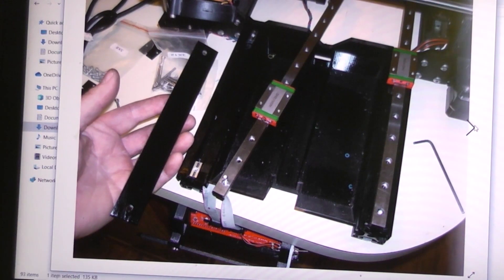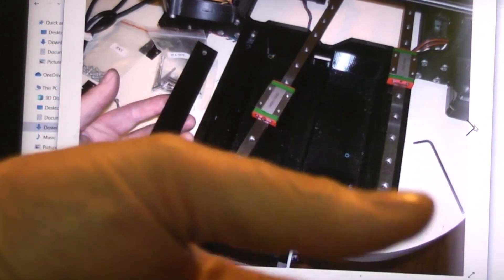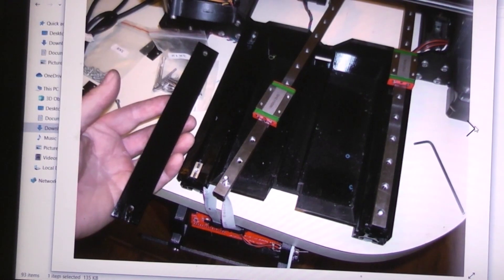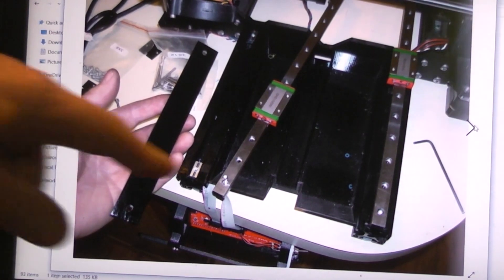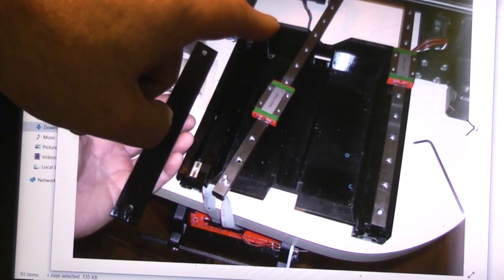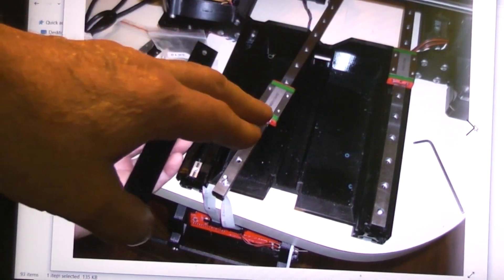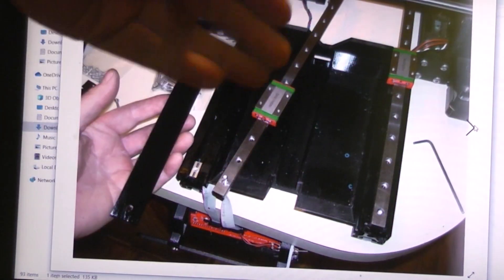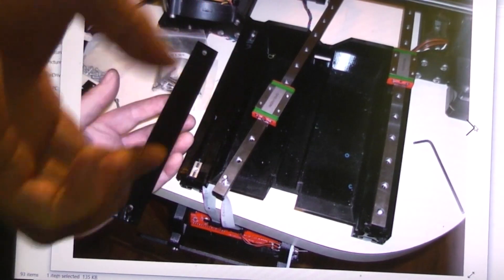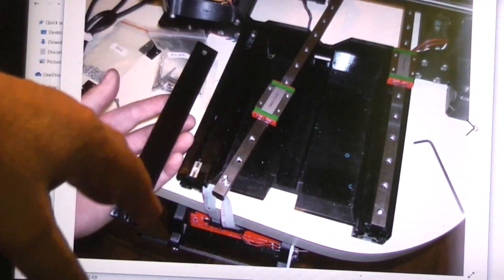I took the two rails out to the shop, measured the length I wanted and cut them. You have to use a fibrous kind of blade — you put it on your skill saw and it's for cutting metal. Since it's a tempered metal you can't cut it with a hacksaw, you can't even drill a hole in it. But with these fiber blades on your skill saw you can cut them. The first thing I noticed is that I could lay the rail in and it would pass through the cutouts in the frame no problem, but the carriage would just hit. I also noticed that the complete rail assembly is lower in profile than the total height of the old rod and LM bearings by about two to three millimeters.